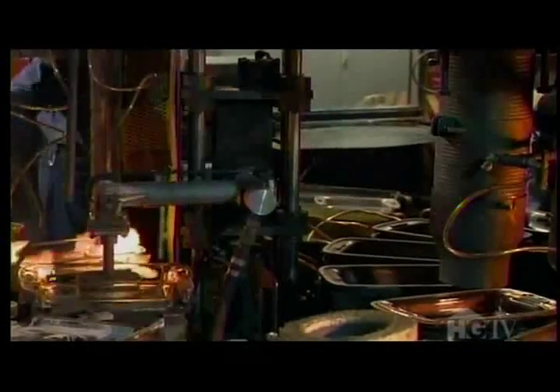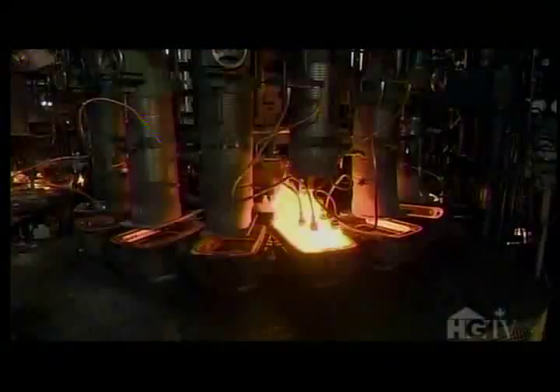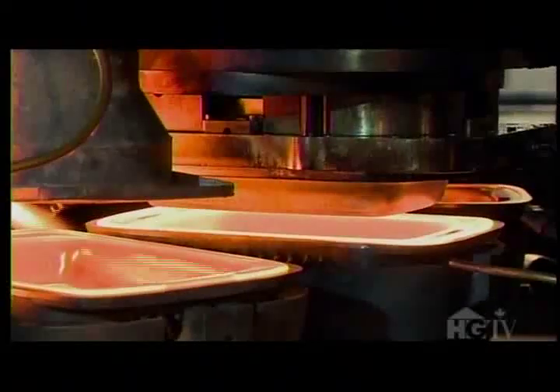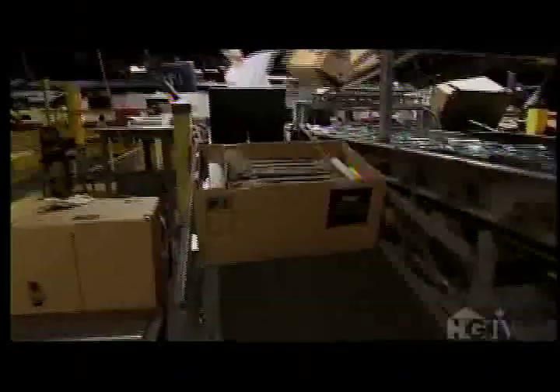The solid pieces are removed from the press by a vacuum-powered arm and placed on what's called a glazer to be polished by fire. It rotates underneath a series of overhead burners, putting a nice, smooth polish on all the rims — because with the mold-ring-plunger interface, we end up with a lot of sharp edges, so we smooth those over. The baked dishes are then loaded into a heat-strengthening kiln, which gradually heats the piece up close to its softening point to remove all internal stresses, then cools it off very quickly to instill the heat-strengthening properties. Finally, the glass is cooled to room temperature for one final inspection before packing and shipping.